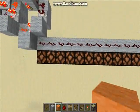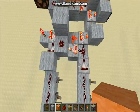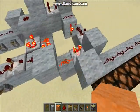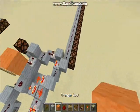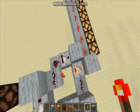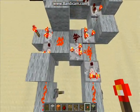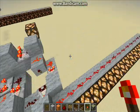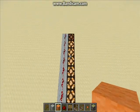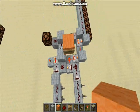It would still output 15 here — it wouldn't turn this off and carry. So what you have to do is detect for that. This here detects if there's going to be a carry, and if there is a carry, it carries out and also shuts this off. Turning that off makes it not output at all, and then whatever's left basically gets added. We can have this, and since this is a strong carry signal, it would output here and get sent down there — and that would be 14. And since there's 2 here, it subtracts 1, which is necessary for this to work. It's kind of difficult to explain why, but just trust me that it works.